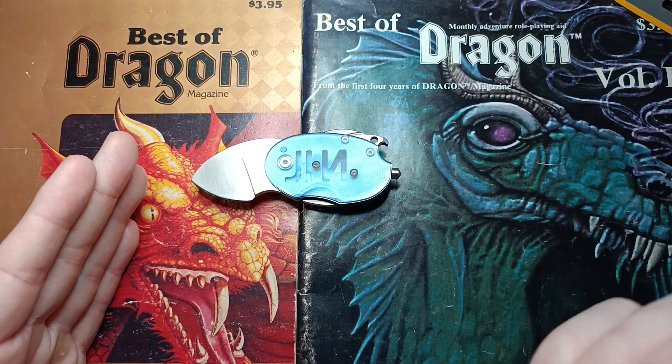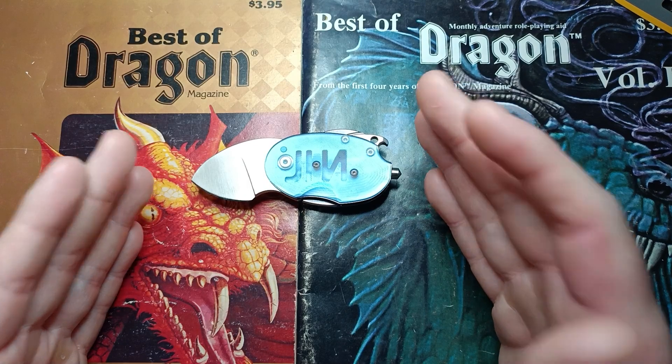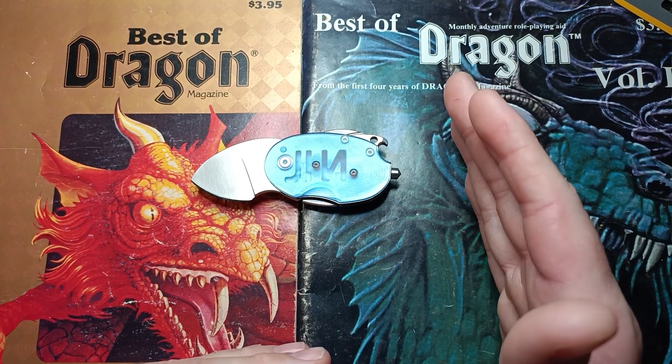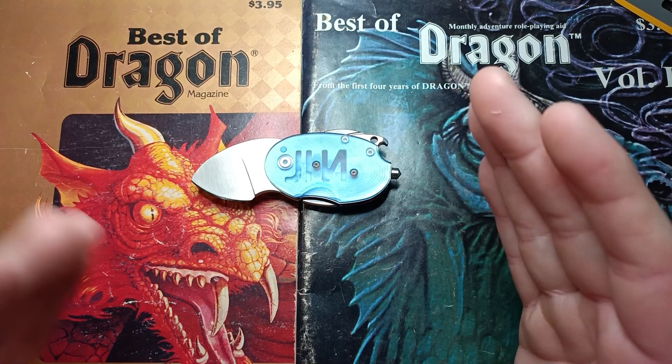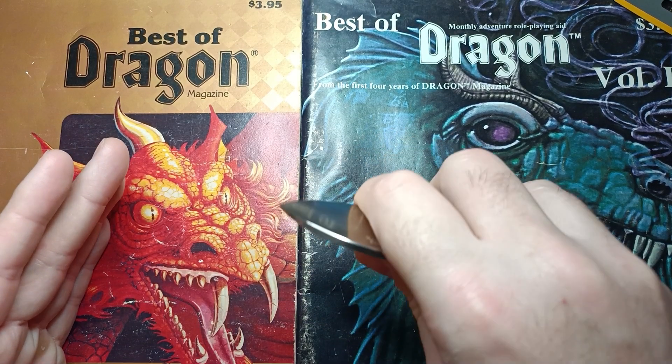The D2 on the captain kit took like four hours to start showing a bit of wear, but this one just wasn't having it. We changed the edge to 18 degrees, re-ground it to 18 degrees, and it was cutting again — but I had to push down really hard to get it to cut.